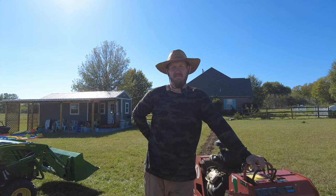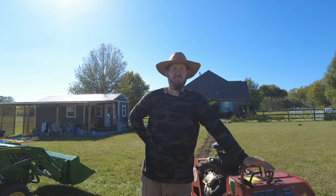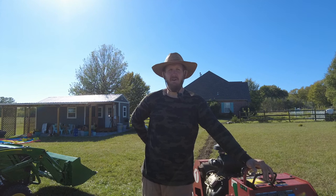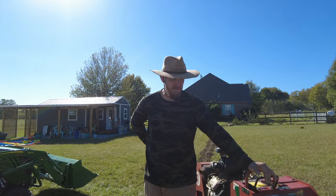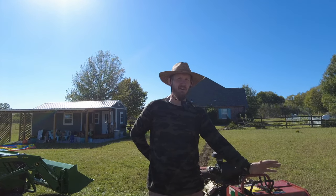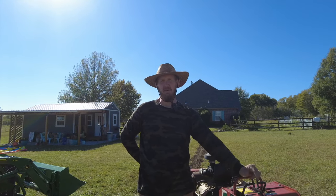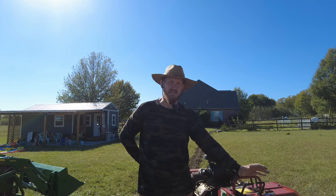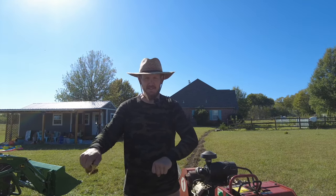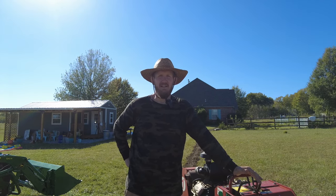Wow. I know this was a bit more of a technical video, but you never know. Somebody might need just the right tip on how to splice into your water main. Half the battle is getting water in places, especially in a more drought-prone climate like Oklahoma. So hopefully that'll help somebody with a much shorter video on how to approach putting the yard hydrant in. I'll walk through it here in a second, but appreciate being able to help anybody splice into your water main without having to dig an enormous hole so that you can kind of bend the pieces and get a T splice in. To do that little snaking thing is a lot easier on the digging.